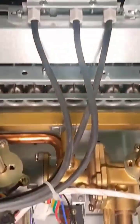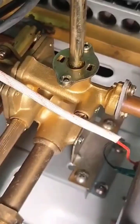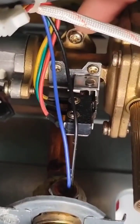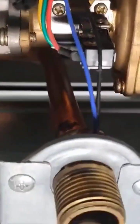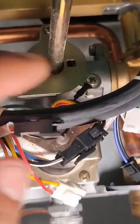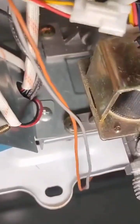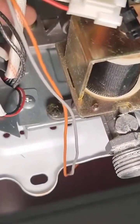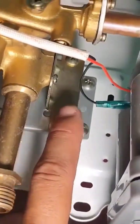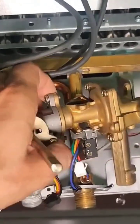Once the water heater is disassembled, as you can see here, for greater convenience we're going to remove a lot of screws — including these two on the water inlet pipe and two others that hold the burner section in place. After that, we can remove the screw that holds the ground wire for the module and also take out these fasteners. Then we can put in new ones. Down there you can see two screws on the gray part of the base, and on the right side there are also two more screws. After removing all of those, we can take it out to work on it.